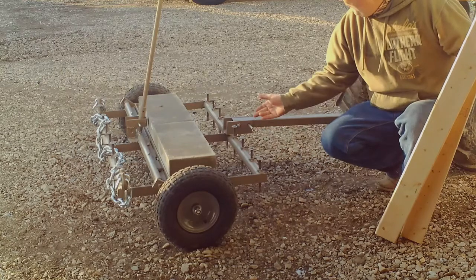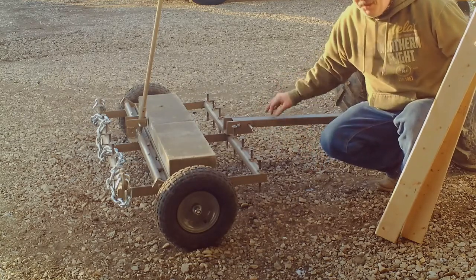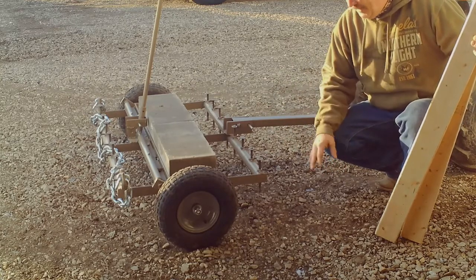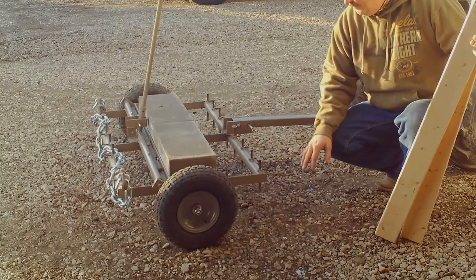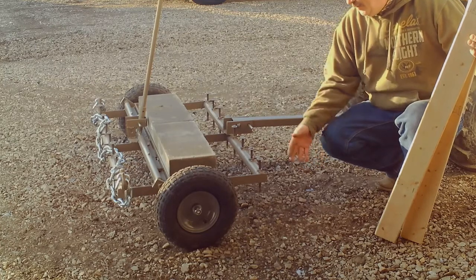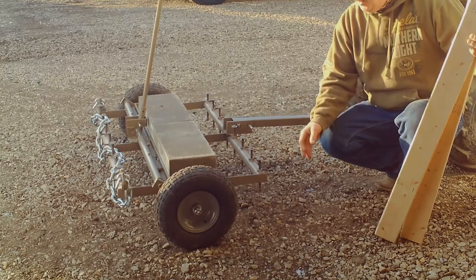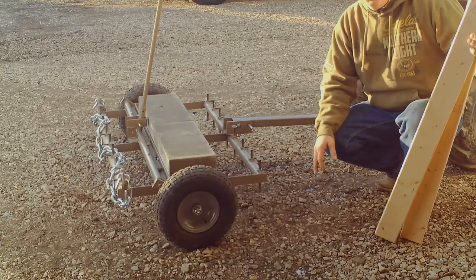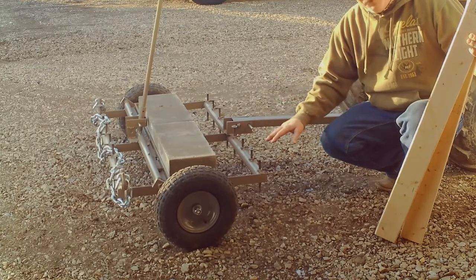These old driveway parking lots like this one used to be mostly mud, completely grass, sprayed all the time. Some of the neighbors have the exact same thing, old gravel driveways and parking areas that have never been taken care of. So you don't really know how much depth you have for top gravel. I'll let you do a test, but you should at least have 3 to 4 inches before you get to your bed, and more if it's a good driveway. Don't really know, but all you're trying to do is get down where the gravel still is.